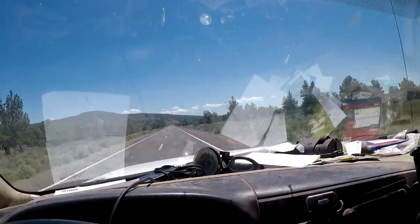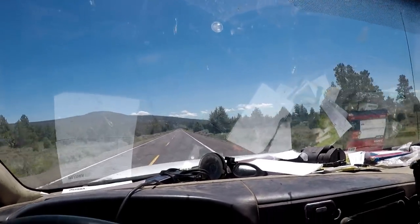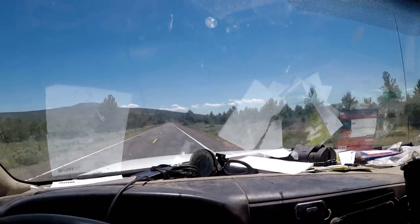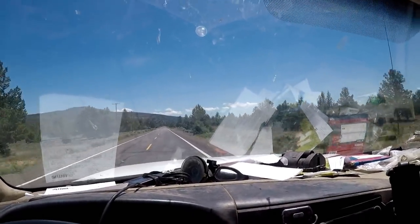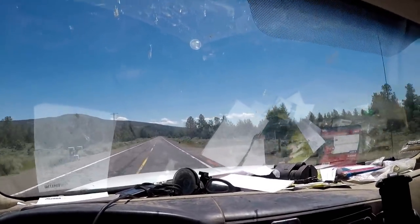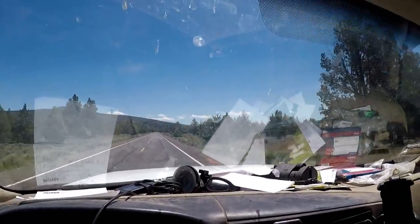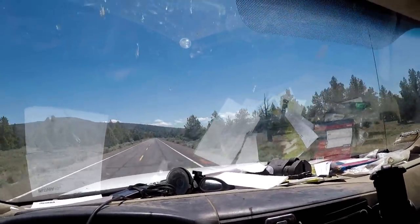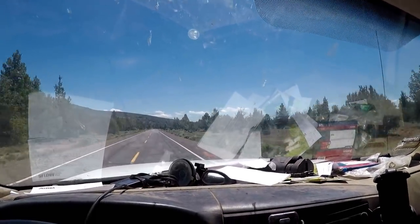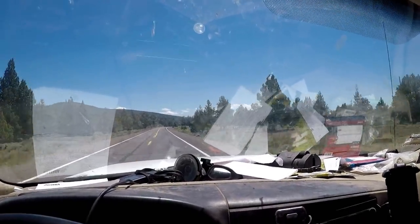I did a backhoe the other day for a guy over in Bonanza, and his operator had run under a low tree branch with it, and the tree branch hung up on the stack and ripped it off the muffler up underneath the hood. And they wanted $700 bucks for that little 580 Super M backhoe stack, so we went over there and welded that together for him and I think I charged him $200 bucks. I spent more time driving out there. It was damn near a 45-minute drive to get out there.